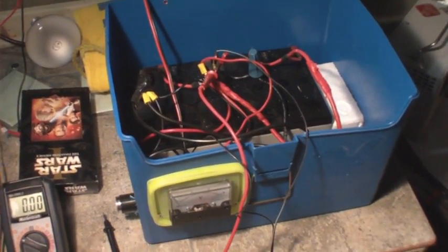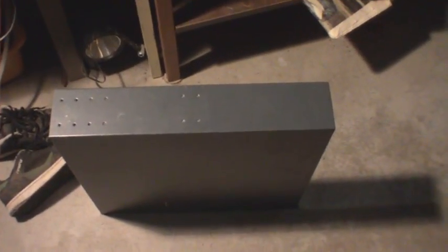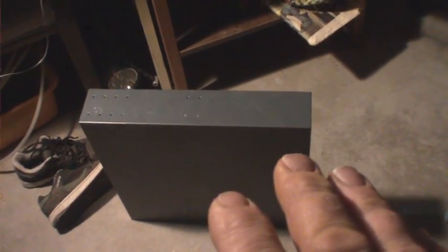Probably the most interesting part of this whole video - what I recycled today. It came in this case here, and it had six of those style 7 amp-hour batteries. They were running at 36 volts. This is not the full UPS system - it's an additional battery pack component that goes with the matching inverter. When you can get your hands on these, it's actually better in a way because they're just batteries. Typically what you'll find is a couple of batteries, or at least one, will be sitting between 9 and 10 volts while the rest are up. That one battery is just bringing down the whole system.